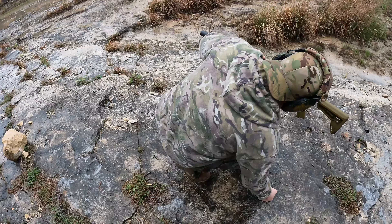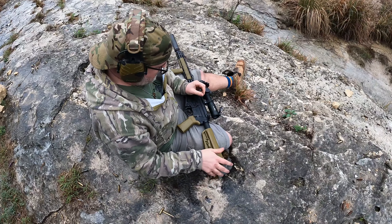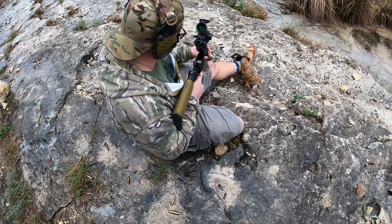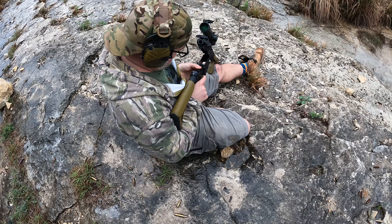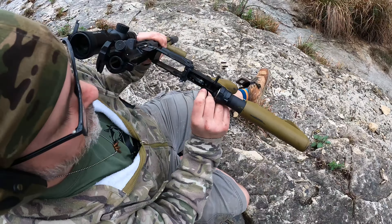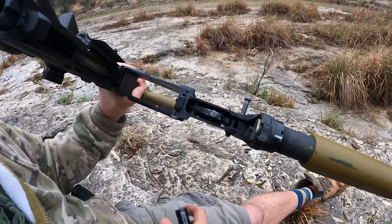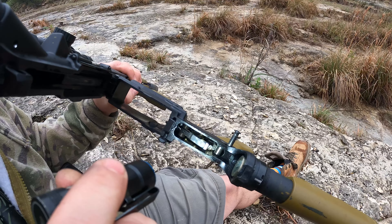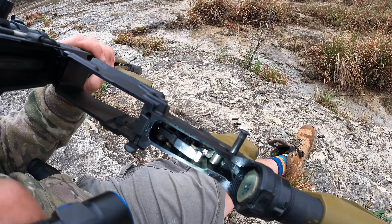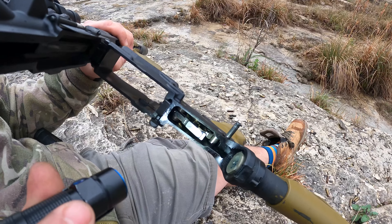I'm gonna sit down, keep recording. The hammer wasn't firing. Look — there's a primer stuck down in there. Probably can't see it, let me grab my flashlight to shine some extra light on the subject. If you can see down in there, almost underneath the safety, there's a primer, and that primer is impeding the function of the trigger group. That's our problem — we'll get that out.